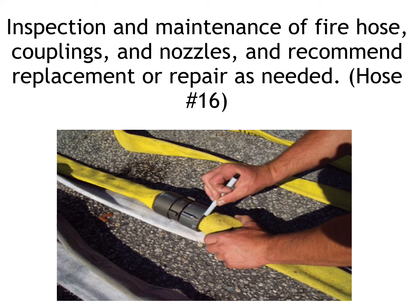Now, if you were going to want to do this at your home station, it's a pretty easy process. All you do is stretch the line from your truck, and you can do this with everything leading up to and not including the supply line. Supply line has a different test procedure. But you just take the hose, stretch it from the truck, put it in a straight line, and then you're going to put the truck in pump gear, engage the pump, and slowly increase the pressure to 250 PSI, and it needs to run at 250 PSI with zero water flowing for 10 minutes. After 10 minutes, you're going to shut the truck down, and go make sure that there's no burst or seeping leaks or spraying leaks from the hose. If that hose is leaking, it has failed.